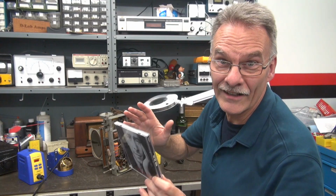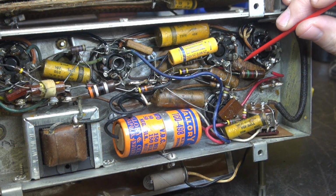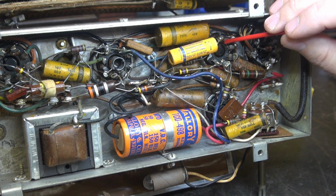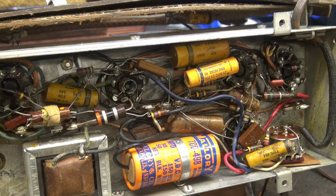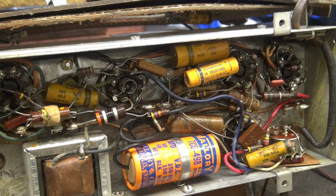They are absolutely killer. All right, so close up view, looks like we got three or four caps here directly terminated to the socket of the 35L6 tube. So we're just gonna cut one out at a time. First cap's changed. That old dripper's out. Is the noise gone?